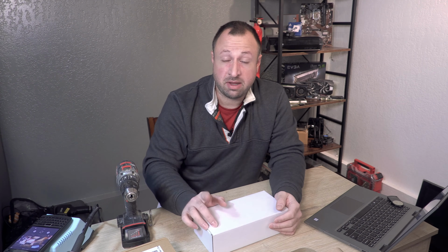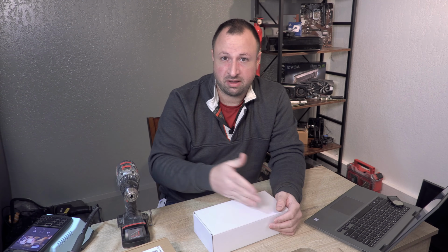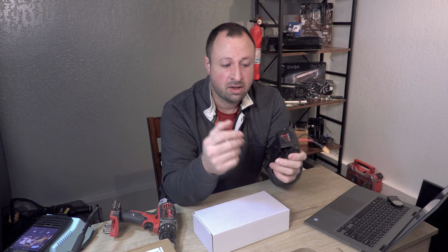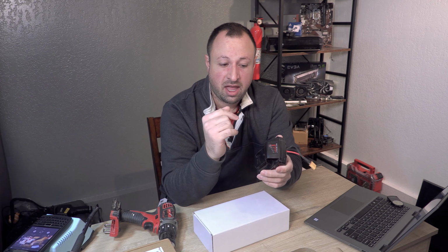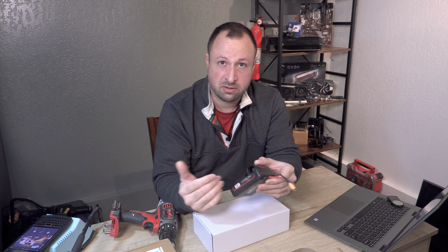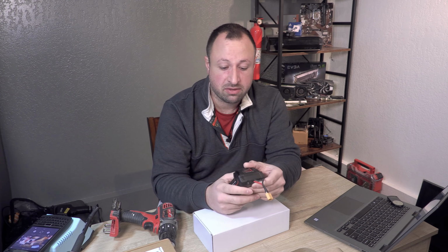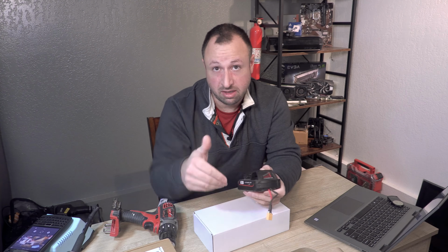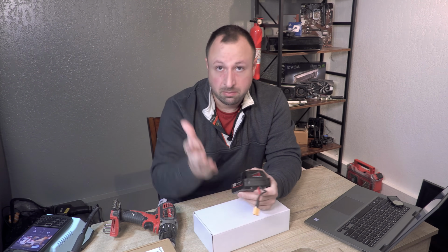And one thing I do want to say, based on my conversation with Alan, in case you watched this before you've started any projects: if you're building one of these, go back in time to the first video in this series. There are some tabs at the front when you start snipping off the 18650s, and they're the forwardmost ones that you need to solder the inputs to. If you don't solder to the very front ones, then you're just going to be hitting the battery rail and it's not going to do anything. So make sure you look closely at the video to see where I'm soldering, and if you have any questions, again, comment below. But let's take it away.